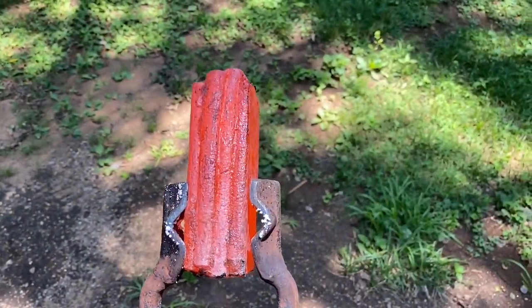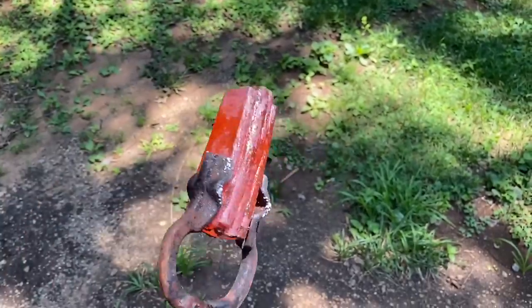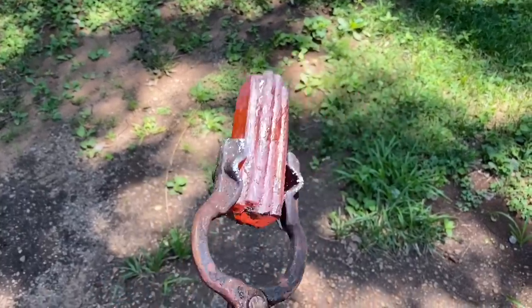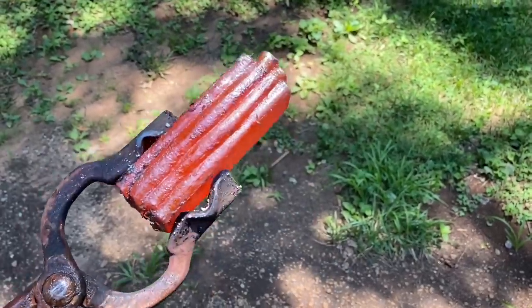Alrighty, so after the second weld, we're looking pretty good. It's behaving as one piece of material. I don't see anything coming apart. So now we'll turn it on its side, keeping it at a welding heat, and try to work this down into a square stock. You know, this is where your welds are the most likely to delaminate when you work against the plane of the weld like this. So if it holds up, we can be pretty confident.